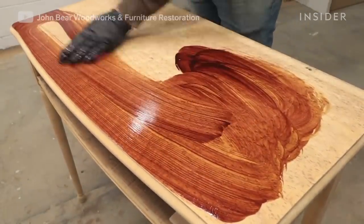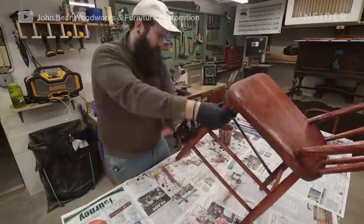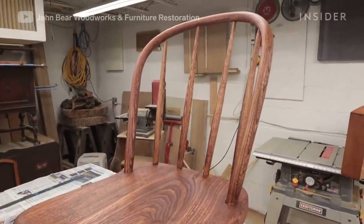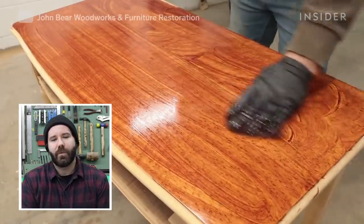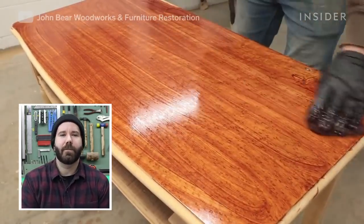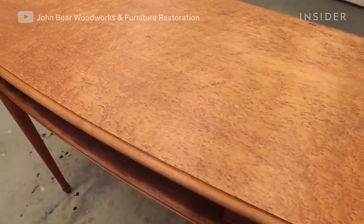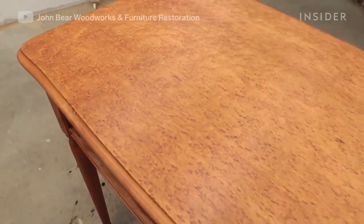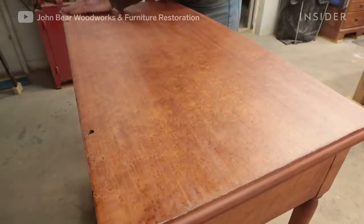I will use an oil-based stain that I mixed to my preference — I like this reddish tint because I feel it really brings out the bird's eye maple a lot more. I typically tell people when I'm working on a piece that red mahogany tends to look a little bit more elegant or refined. Once the stain has had a chance to set up and dry for a couple of days, I apply a seal coat of lacquer before I sand that and apply the final topcoat.